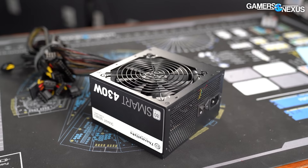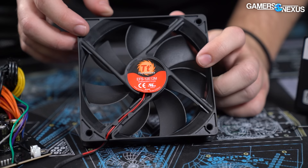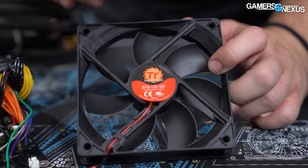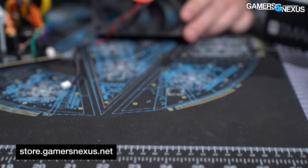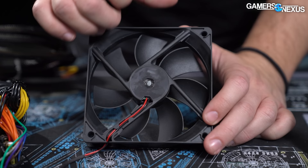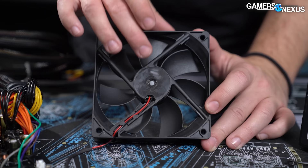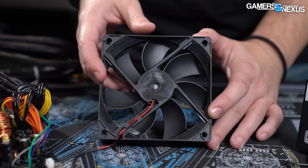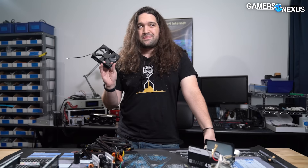Overall this sets you up to run a pretty basic video card — no more than two 8-pins, but you probably shouldn't really be close to that anyway. The fan is labeled Thermaltake, called the EFS-12E-12M, a 120mm fan. Pulling the label reveals a very simple and cheap rifle-bearing core, confirmed by destructive testing. The actual manufacturer is Huaxingrong, marketed as a 12-volt, 0.25-amp fan — basically the same thing you'd find in a cheap case.